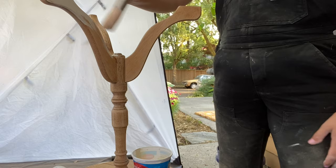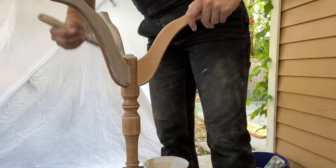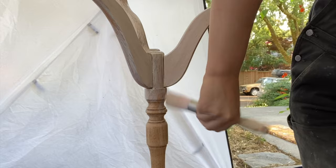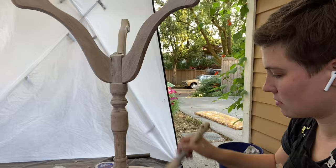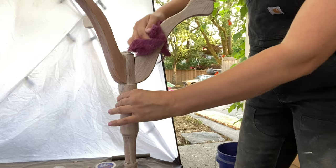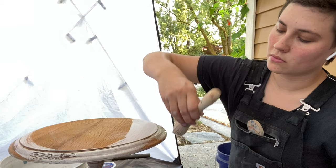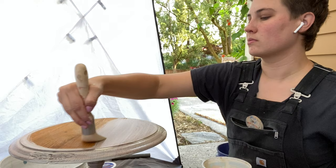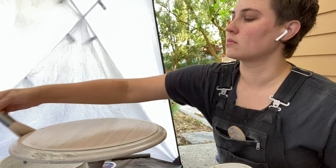I'm just finishing up the first layer of this paint wash and then I'm going to wipe it all back with a rag. This will still leave on a bit of the paint wash — just a nice semi-transparent layer. The goal here is to lighten up the wood but to still be able to see the wood grain, so I'm not trying to paint it white; I'm just trying to make the wood look lightened and brightened without using bleach. Chalk paint is amazing because it either has no VOCs or very few VOCs depending on the brand, which means you don't have to wear a respirator, you don't need gloves, and it's not going to stain your clothes — it's all water-based.